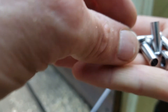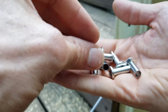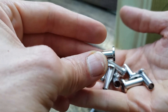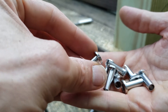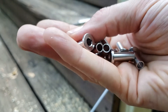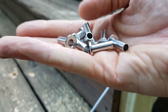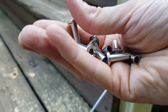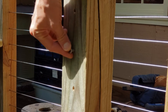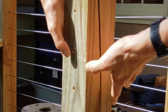These are the wood protector ferrule bushings that you can put into the wood posts to make the holes look nicer. You could use them on every single hole but it would end up costing a lot of money. They look really nice, they're really well made, stainless, with nice chamfers. If you want your setup to look really good, this is the way to do it. But I'm only using them where I need the hole to be very strong — like at the top of the steps where the cable goes at an angle, or at corner posts. They're pretty expensive, so I'm only using them where I need the strength of the bushing to keep the cable from digging down.